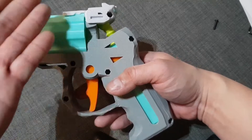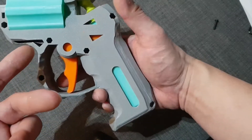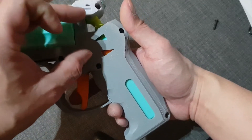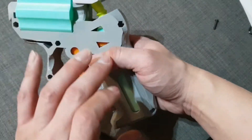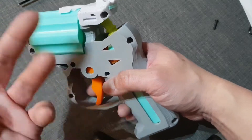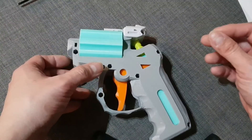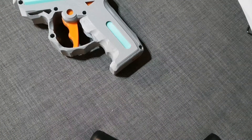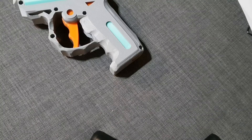So the trigger reset — there are three factors. The first one is just make sure it is stronger here in terms of spring power and weaker here. Also gravity drop. And then the last gentle push by the TPU flex spring. So that's the answer for Tyra and Banshi — that's the rotation. The other one is trigger reset, and I already talked about that.